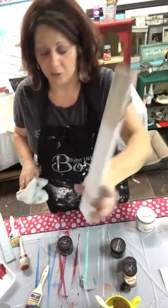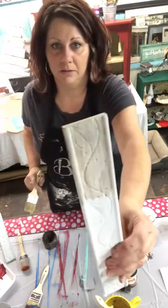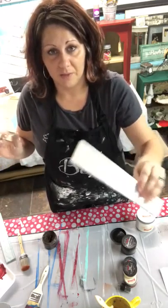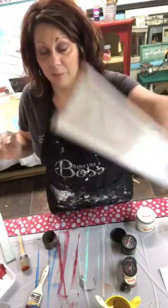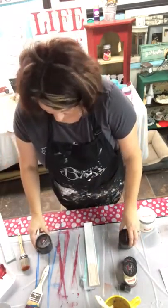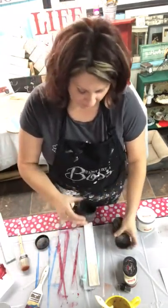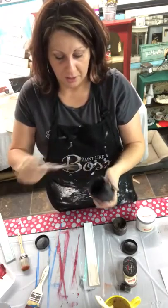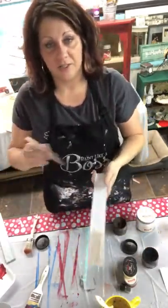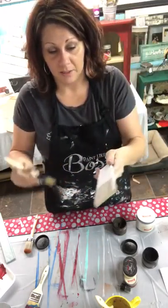Soft wax takes a couple of days to cure, but you can also blend a lot more with soft wax. What I used on here is antique brown — that's the Venteeks line. A lot of people like that rustic, primitive look: they paint it white and then put brown over it, and that's exactly what you'll get. This is the best way to test a piece of furniture — what it's going to look like when it's done. We're going to use just one color of paint and I'm going to use different waxes.